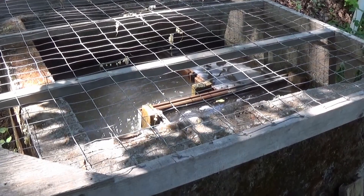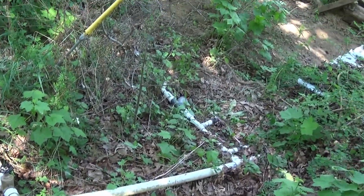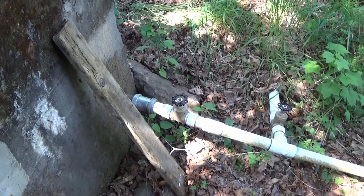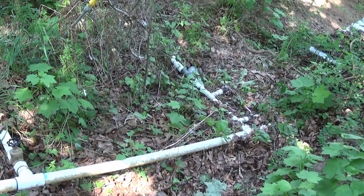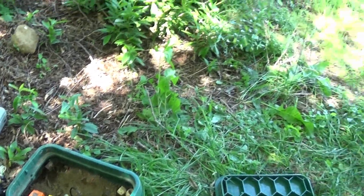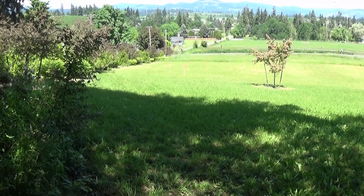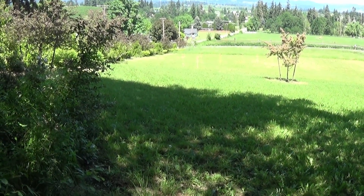Here's our water source. It's a gravity fed water box flowing out with only about 5 feet of head to our valve box that sits right down there with our motor actuated ball valves. No solenoid valve will perform on this low of pressure. The only thing that performs are the motor actuated ball valves. From our valve box, we're running downhill strictly on gravity, supplying water to these trees and this landscape out here. It works perfect on a gravity system, as long as your target is downhill from your source.